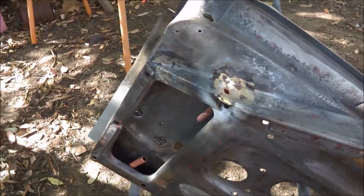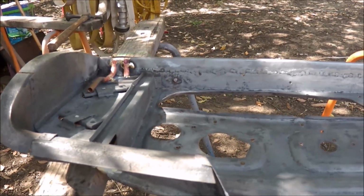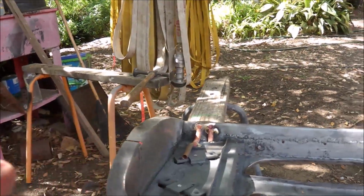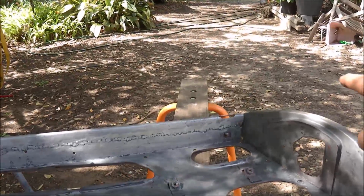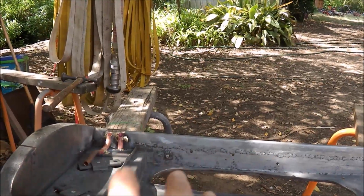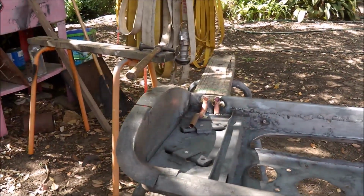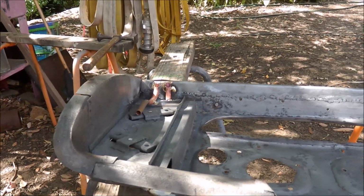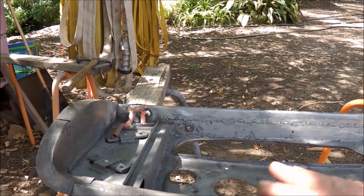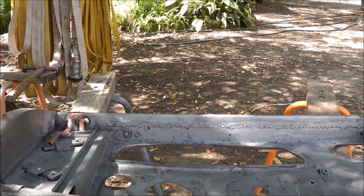I'm not going to put the skin on yet. Originally I was, but what I've been looking at, seeing I've taken off the bulkhead panel on this side, and I've got repairs to do to the body on that side, it would be better to line the door up, or the door skin in particular, with the curve of the vehicle once I've got those panels in place. So this I've already fitted up to the door opening. It fits, the opening's fine. It seems to be not twisted, but I've yet to put the skin on.